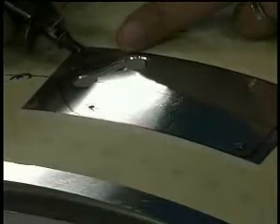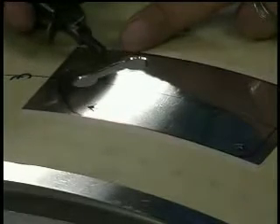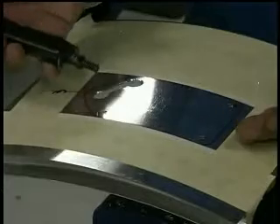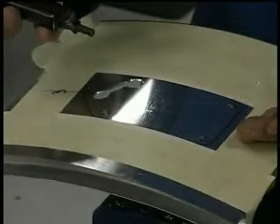It sometimes takes a little bit of wiggling because it's a shearing action with a little bit of force. I've cut between those two holes and removed all that material. You'll notice I've stayed a fair distance away from my mark because the nibbler does some scratching and distortion, and I don't want that on my aircraft skin — so I start off fairly far back. Nibbling around the perimeter of the cutout, whatever shape it is, is a viable way to cut a hole into the aircraft structure.